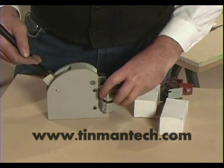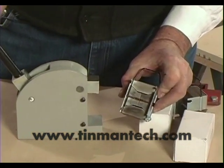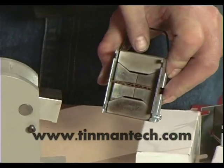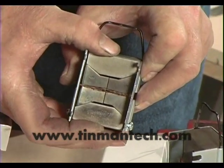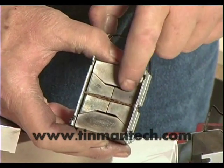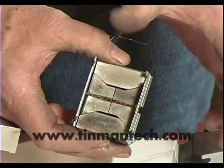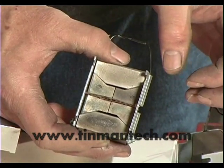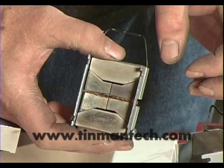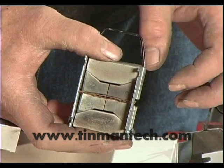The way this machine works — if you look on the back side of the jaws, you'll see that with pressure downward or pressure squeezing together, these jaws move apart. Each one of these jaws tries to escape and pulls the metal apart. So you have to be very careful because you will tear the metal on thin, soft material. Copper or aluminum will tear rather easily.